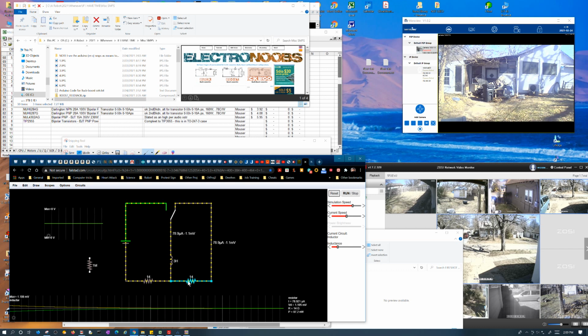So if you start with the same impedance, it'll take the same amount of time to discharge it. But again, if you go with a lower impedance, say 10 times lower, it's going to take 10 times longer to discharge it because it's trying to maintain the same current. So it doesn't care if it's in a lower impedance. What it'll do is just lower the voltage, and that's exactly what it does.